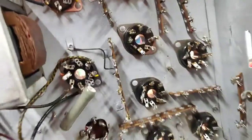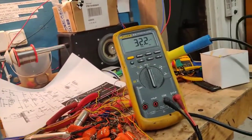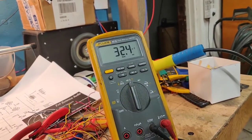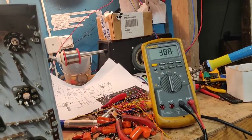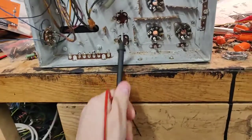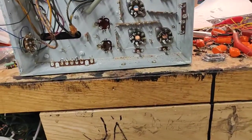The square cap is 40 microfarads at 400 volts - it was supposed to be 40, but it's measuring only 32. That's really not ideal. The triangle cap is 20 microfarads, and when the meter jumps like this it indicates leakage - that's something I've learned about this Fluke meter. So yeah, these filter caps are bad and we're not going to be using them.